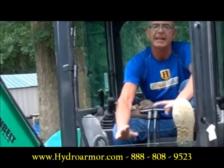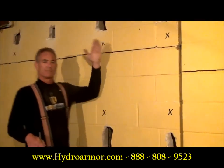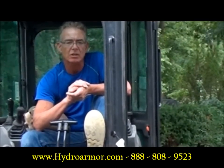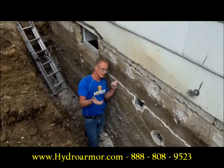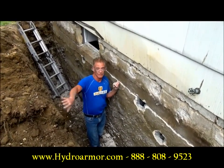On this job, we're not completely taking out the wall. We have a horizontal crack and this wall would go. You can just put wall pins in or put I-beams up, but that's going to look like there was always a problem with the foundation. If ever you want to sell a house, if anybody goes into a basement and sees a bowed wall, they're leaving the basement and going to look at the next house.